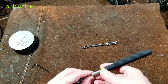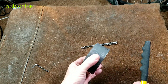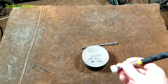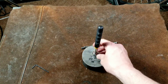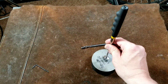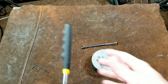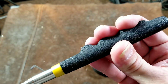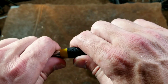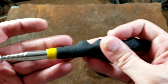As for real strength, this one is quite reasonable. The 15-pound unit is as advertised, but you need a real strong cross section to achieve that. Here we have roughly a four-inch diameter by one-and-a-half to two-inch thick piece of nodular iron, and we can use this tool and see that it easily picks up a pretty large piece of steel — definitely a nice high-strength unit. I also appreciate the over-molded handle, although I suspect over time it may want to slip off.